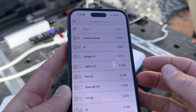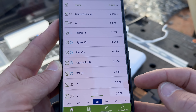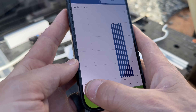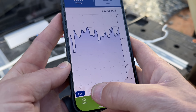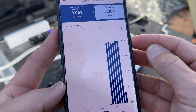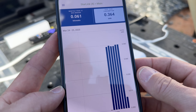If you want to go a step up, these are Emporia smart plugs. Most people use these for on/off remote capability and smart home integration, but through the app they have really good power and energy consumption bar charts. I just open up the Emporia app and I have all my different smart plugs — for the TV, Starlink, fan, lights, and fridge. It gives me overall today what those have used in kilowatt-hours, and I can drill down to a live watt reading in real time or roll up to a minute, hour, or day level to get my numbers for the spreadsheet.